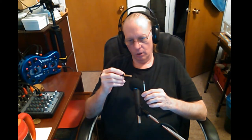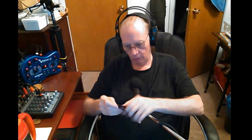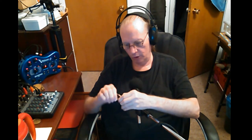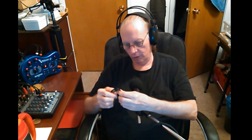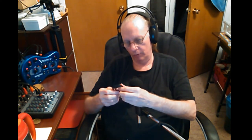I mean, if your pins would line up to just the right two, you know, this is a TRS, but it's really for stereo. TRS is tip ring sleeve. It's a balanced signal. It's different from a stereo signal. It's not even anywhere close to the same thing. TRS is still a mono signal, but it's a balanced signal going through those three wires, instead of unbalanced, which would just be TS, tip sleeve. Tip sleeve, TS, and then tip ring sleeve, TRS. So,